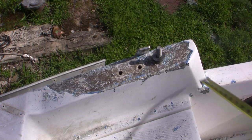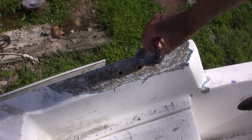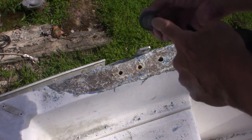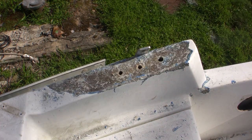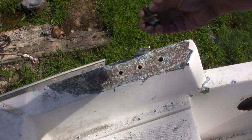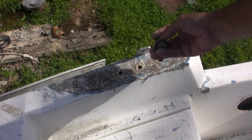If you put a whole bunch of sockets together it's gonna flop around, so you really need one solid socket. Then you can put an Allen wrench right up in there and it'll just set, and you just spin it around. If you have an air socket wrench it goes right in because you don't strip it.